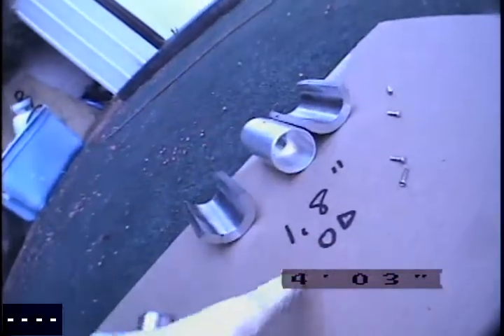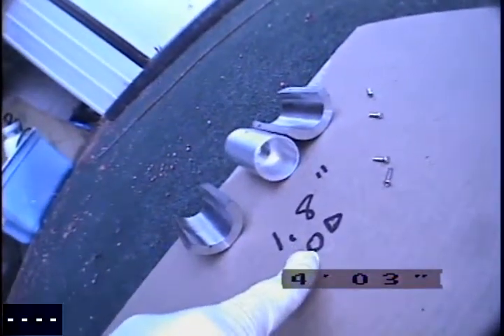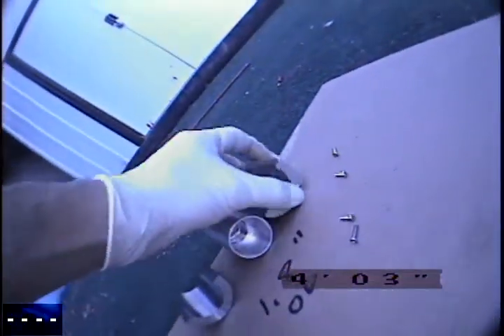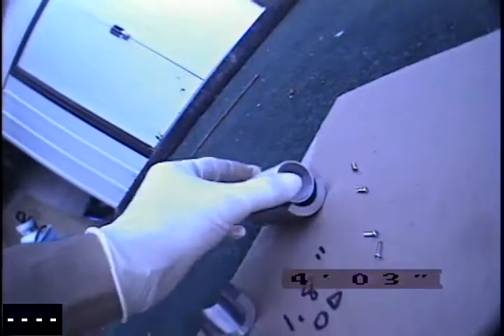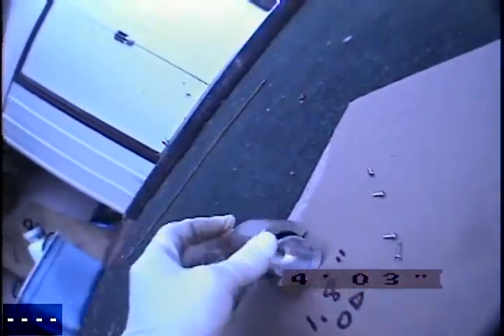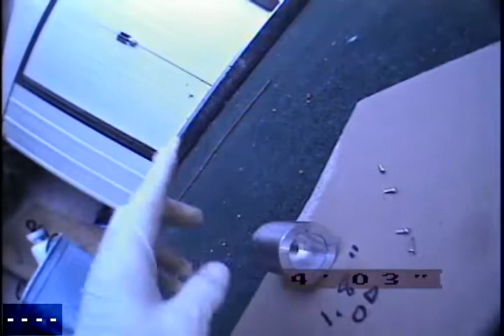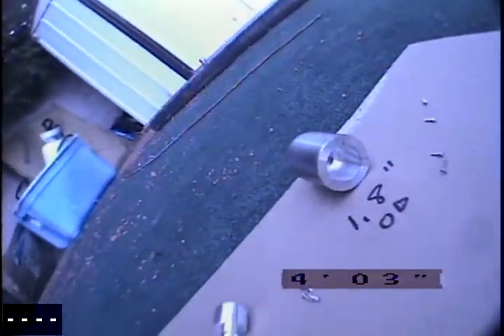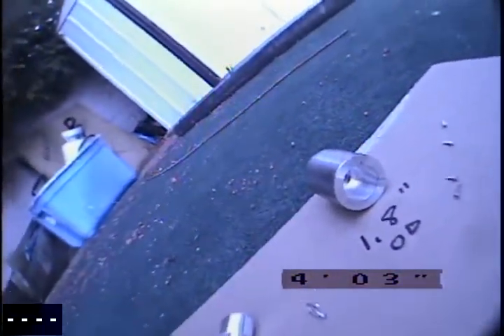This is the one on the camera head right now. It's 1.8 inches in outside diameter, so we have a 2-inch piece of cast iron here — we're going to show it going down. By creating a steel shell that goes over the aluminum that holds the magnet, we're able to stop any diametric magnetic force from sticking to the wall of the pipe. So now we're able to go down any type of metallic pipe and retrieve the item without sticking to the pipe itself.